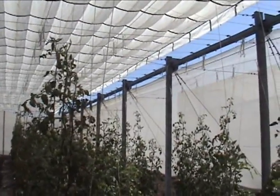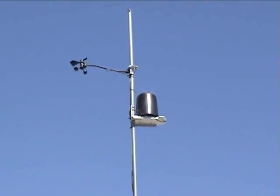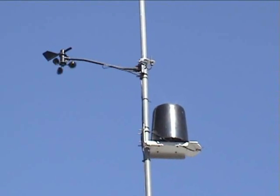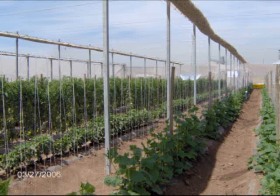To prevent the plants from damage, a rain sensor and a wind sensor are installed above the roof on the weather station. The Link 4 iGrow controller can be programmed to automatically cover or uncover the roof in the event of rain. The wind sensor can be programmed to protect the plants from excessive wind damage, and can also be used to automatically close or retract the roof in the event of excessive wind speeds that could damage the structure.